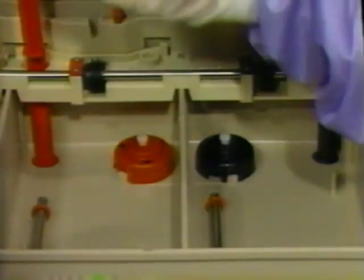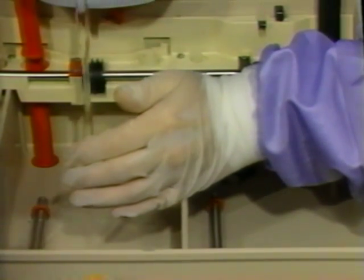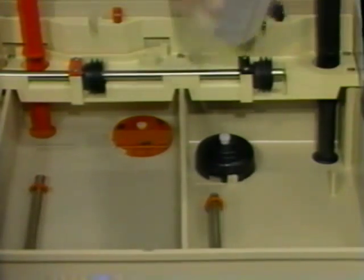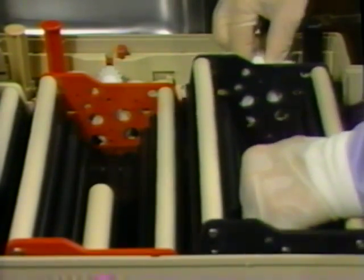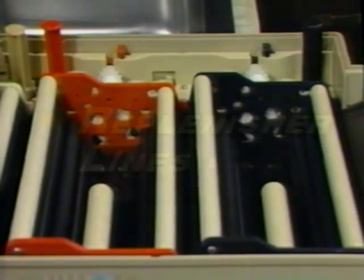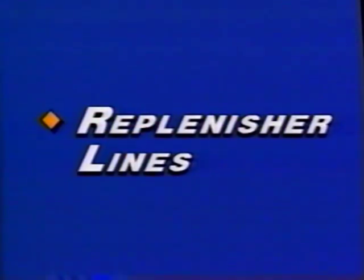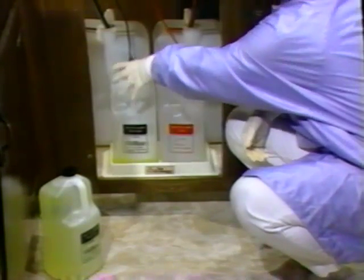Check that chemistry and rack assemblies are in the tanks. If not, first fill the fixer tank to the fill line, then add two ounces of starter to the developer tank and fill with developer to the fill line. Slowly lower each rack assembly into its tank. Do not splash. Make sure the gears are seated properly and slide each rack latch into the locked position. Lastly, check that the replenisher feed lines are submerged into the solution in the chemistry bottles.